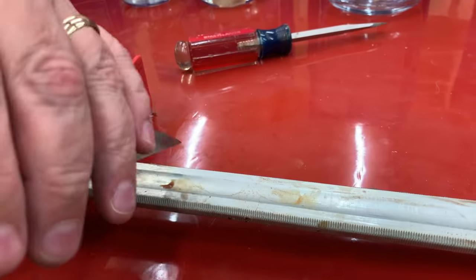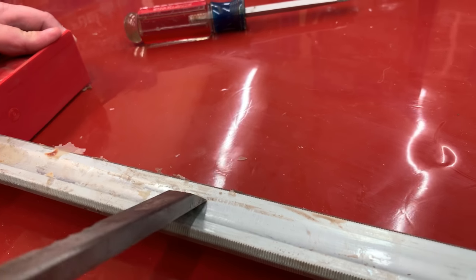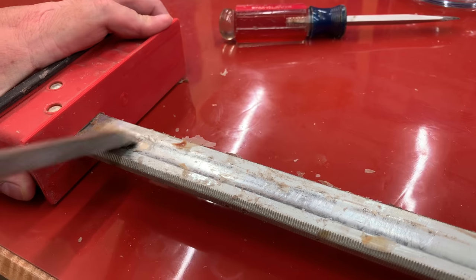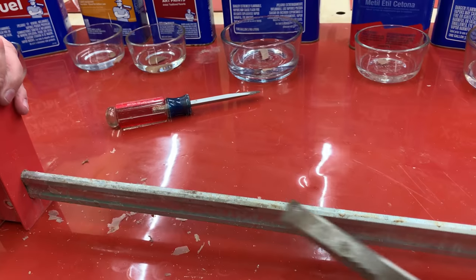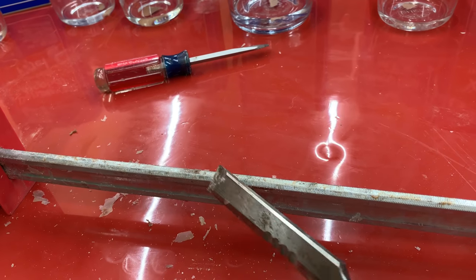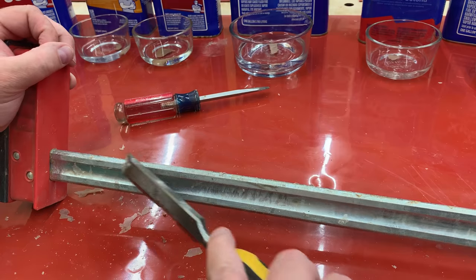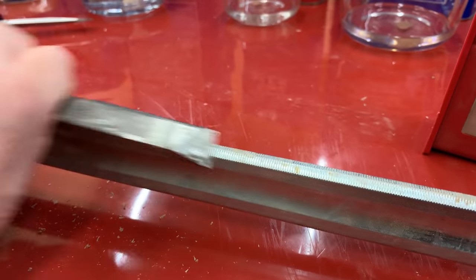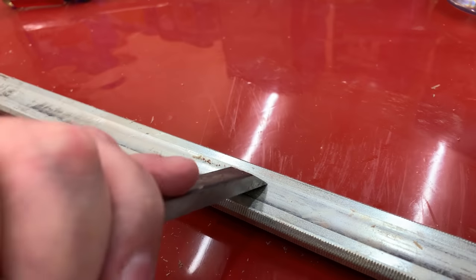The solvent is actually slow to take action, so we don't really want to try to clean these clamps 100% with solvent — that's going to take too long. The best thing to do is to get an older chisel. I've put a link to some cheaper chisels, just $10 chisels, down in the description below that will work really well for this job. You can take these and probably get 90 to 95% of the glue off pretty quickly in about five minutes, and then the solvent won't have that much work to do. I'm not putting very much pressure on the ridges — I want to make sure I don't gouge them — but the clamp is pretty hardened steel so I've never really been able to scrape or wear them down anyway. I'm just lightly going over it to scrape the excess glue off the top.